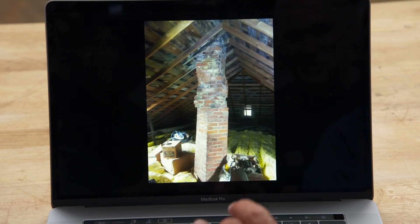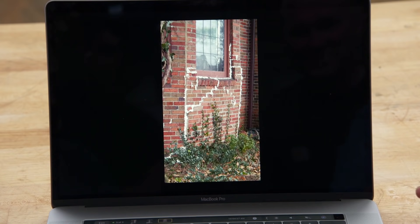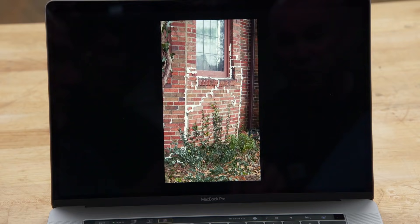Well, here's one right here, Mark. Wow. They clearly need to watch a little more of you on TV. They probably had a draft or something — that's foam insulation. It's a drafty window — why not insulate the brick? The best part is that foam has probably taken all the water into the joints, so it's creating more of a problem than a fix. But if he scrapes it off, makes it flush with a wire brush, he can paint that great. I don't think we're going to find any shortage of these pictures. So keep those pictures coming — maybe they'll end up on Home Inspection Nightmares.